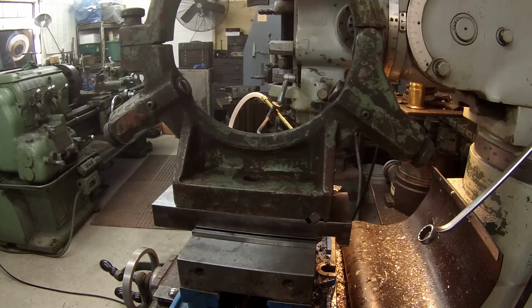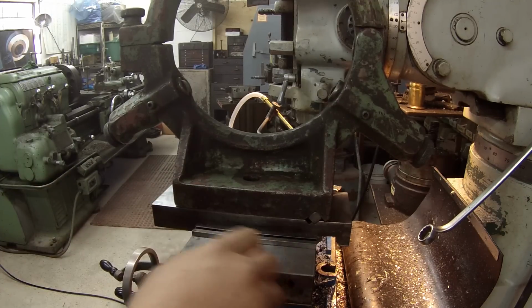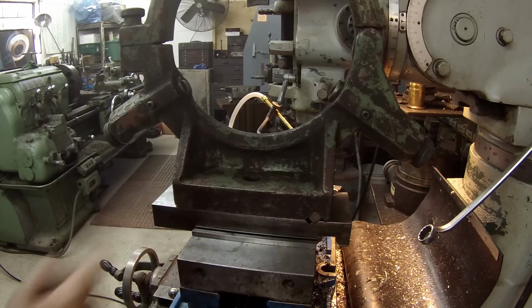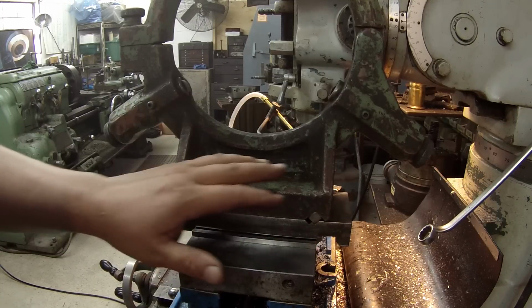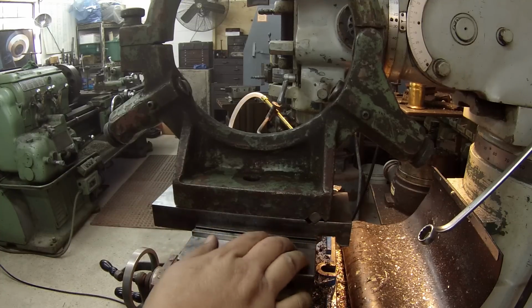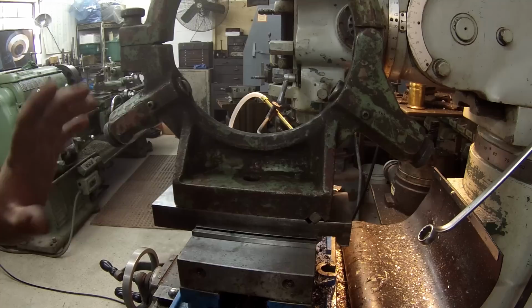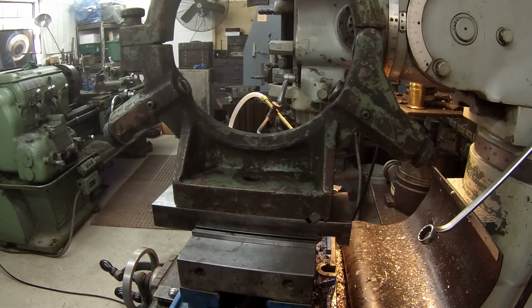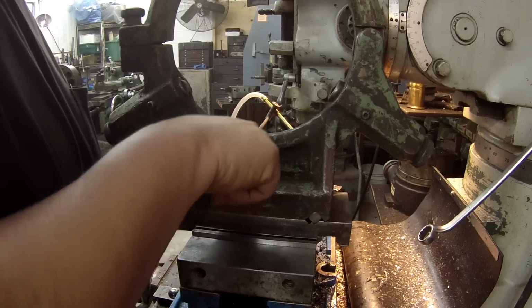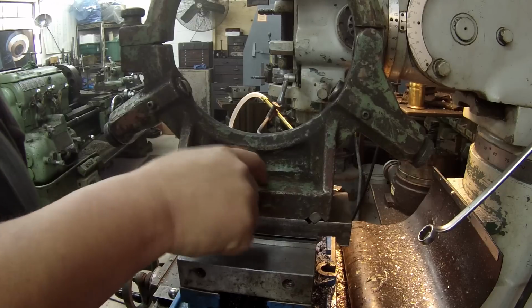All right, here's just a quick update on it. I told you I want to try to salvage it. So what I've done is I lined the groove back up and moved it over a quarter inch and recut it. And I've got it fit just like it was before. It's nice and tight on the key with just a couple thousandth gap right here. So that's going to shove us over a quarter inch like we need to go. And I've actually just reached in here with my Sharpie and marked a line on the center, because I got to move this slot over a little bit also.